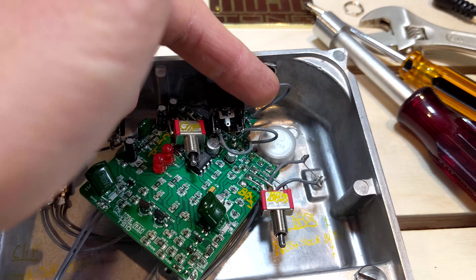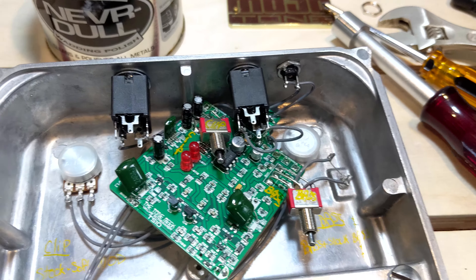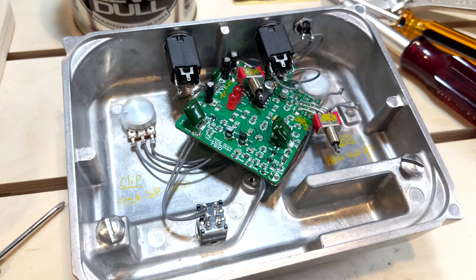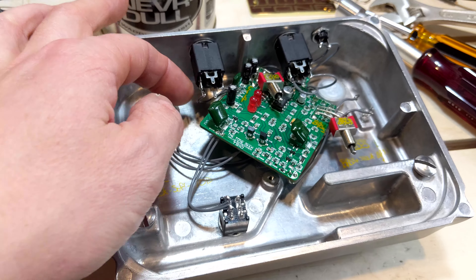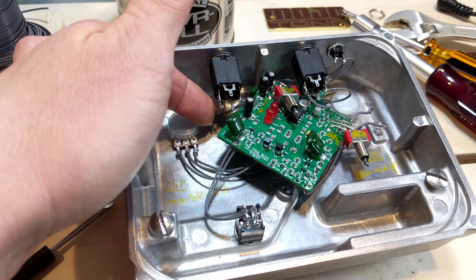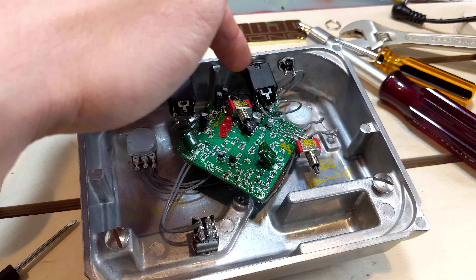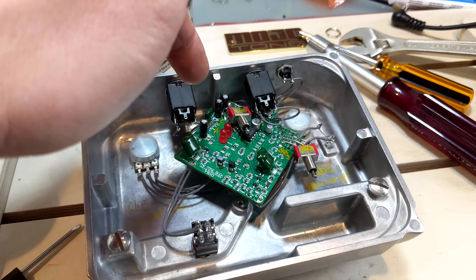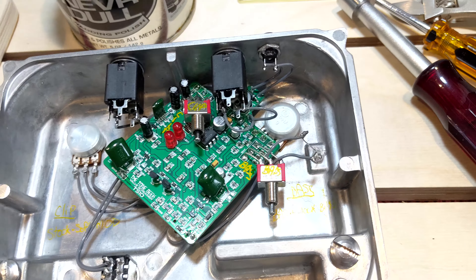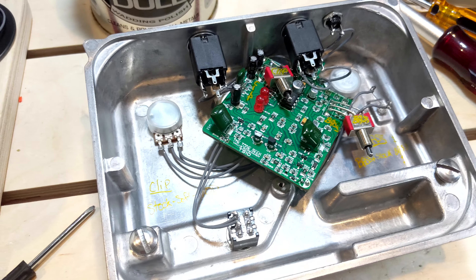I also put super glue or hot glue on the LED nut because it's on plastic and I don't trust it very much. If that slides off, gravity will make that metal nut contact the positive and negative leads and short out — there goes your power supply. I'm also going to pay close attention to make sure there are no ground loops, because of the distance between these two points and the metal case. Ground loops within pedals are fairly uncommon, but I can't imagine they're non-existent.